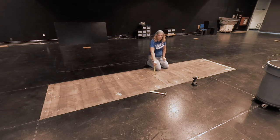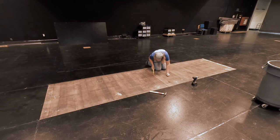were someone trying to screw something into the stage floor, but they didn't realize that this piece right here is sitting on top of a beam. This is a stage trap, and this is a stage trap, and this is a beam that supports the boards between the stage traps. And they were trying to use too long of a screw, and it was going through this piece of 2x4 tongue and groove and hitting that metal beam and breaking off. Wow, I picked a good one, huh?